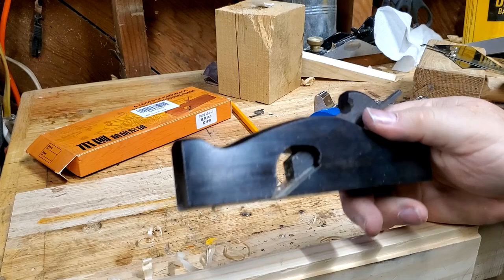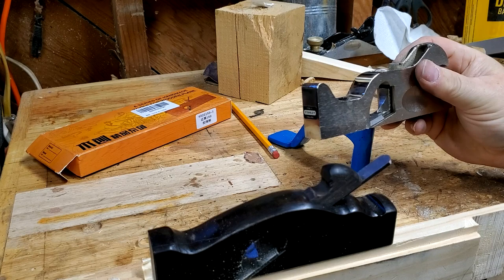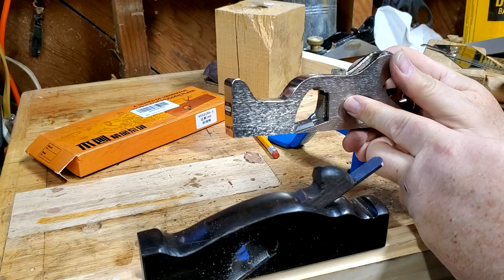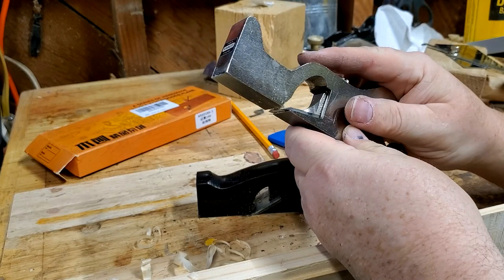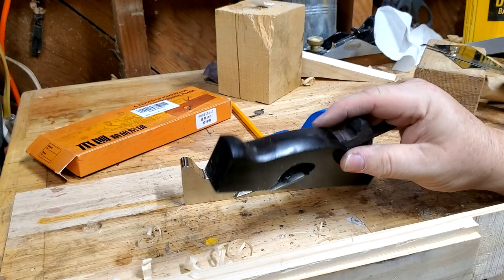So what do I think of it as a tiny little shoulder plane? It's at least a third, or maybe only a fourth, of the cost of buying a modern version of the Stanley 92. The modern version has a lot more features — this one will come apart; the front comes off so you can make it into a chisel plane to get into corners, which kind of doubles its usability. Most modern copies can also have the front ends removed. The modern version has a screw-type adjuster that's a lot easier to adjust, and it has a lower angle, which is better for cross grain. Is it as good as the modern plane? No, not really.